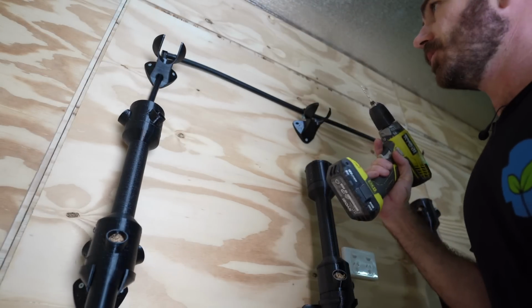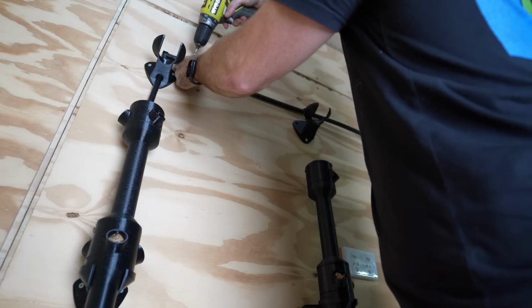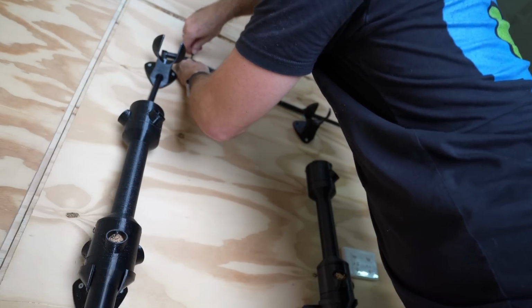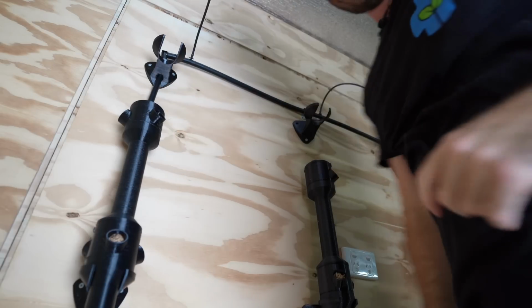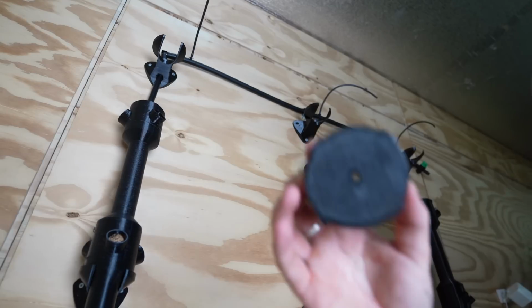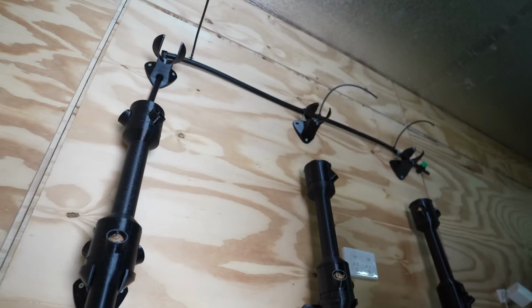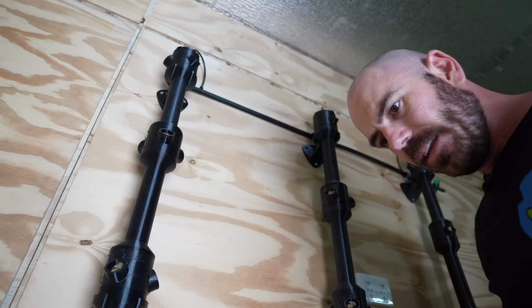I'm just using the flex hose at the moment, but I'm going to drill a diameter that's smaller than the 4mm barb just to make it easier to push them in. So I'll just drill straight in and push my barbs into that hole like that. Good. And we're going to connect up 4mm tubing to that like so. I really hope this doesn't leak. The tops of our towers have a hole in them. It turned out smaller than the 4mm tubing, which is quite annoying. So I'm just going to drill that out as well. Last one. Oh, good. Well, if that's about it, that's about it.